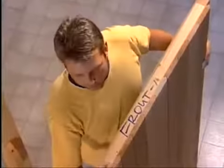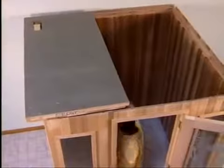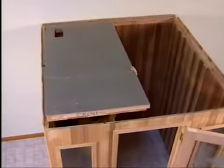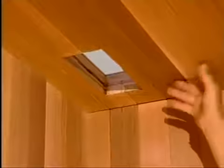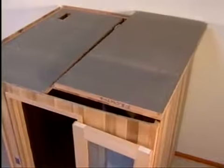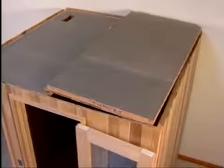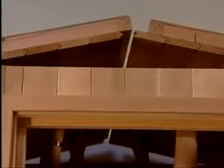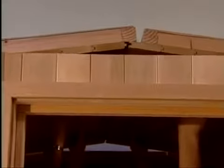Like the wall panels, the ceiling panels are marked for positioning. The side marked 'back' faces the wall. Carefully lift the panel over the sauna and drop it down into position — it will rest securely on the top wall edge. Then lift the panel marked number two into position. To interlock the panels, push both panels up at the center from the inside and let them back down into their final position. Line up the grooves for the ceiling panels with the wall panels.